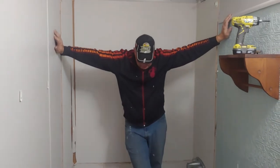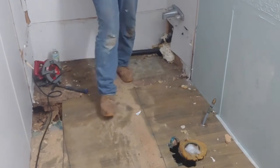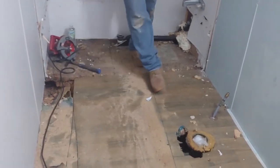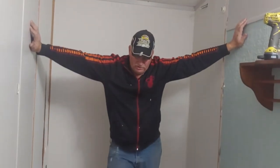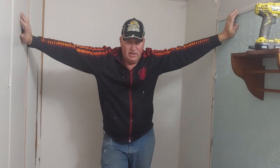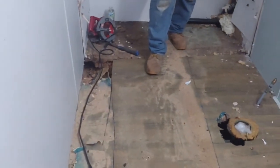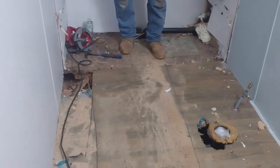So what I've done is, knowing the floor joists are here and here because that's where it's highest and the floor sagged where it got wet — I cut right here on this side of the floor, knowing that the floor is generally held on by a little bit of glue and staples. And this has got a whole bunch of nails for the overlayment paneling holding it down.